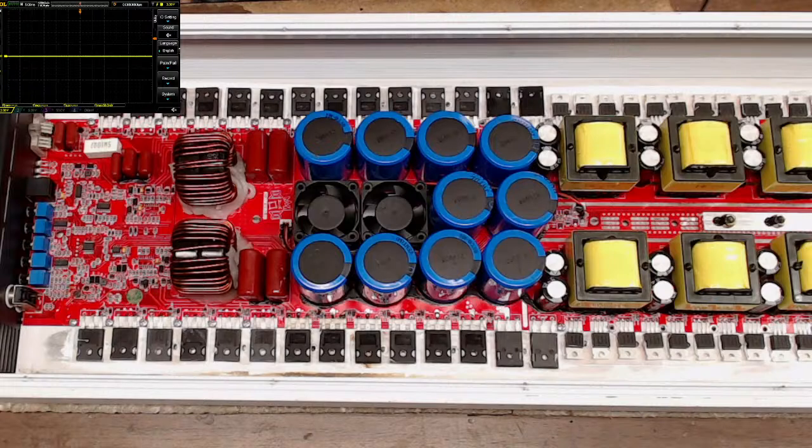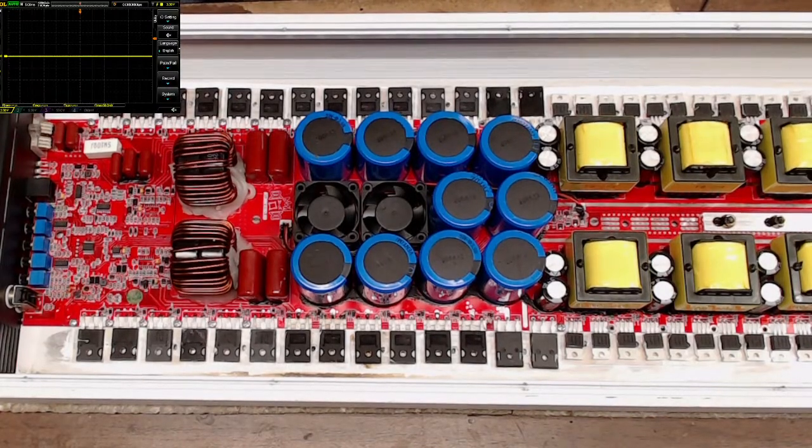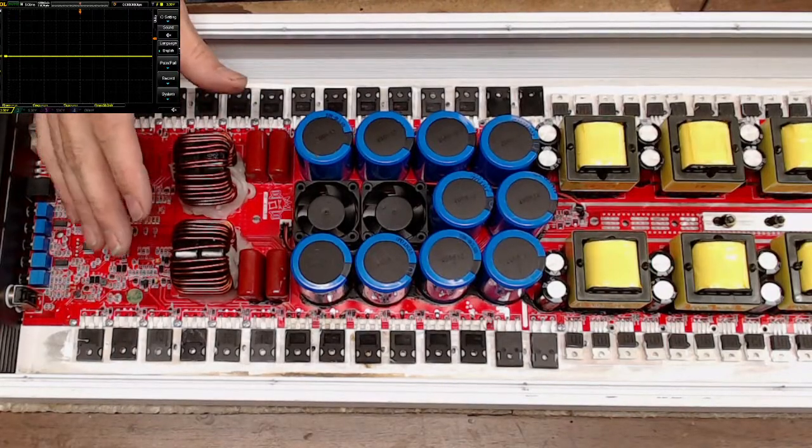So it's not the 90N20s? No, very few amplifiers that I know of use the 90N20s. I do carry a few of them, and I say a few only because they're just not used commonly. I've done some playing around with the 90N20s with some of the 2110 or the 2113 drive ICs, and the 90N20s are, in my opinion, hard to drive. I'm sure I could find easier ways to drive a 90N20, but they're just tough to drive. So yeah, you'll find these D1s being an IRFP4227 on these particular style boards.